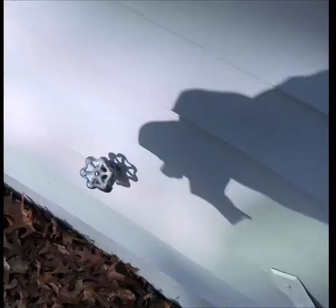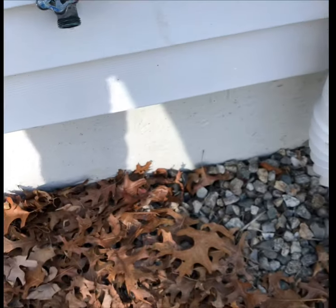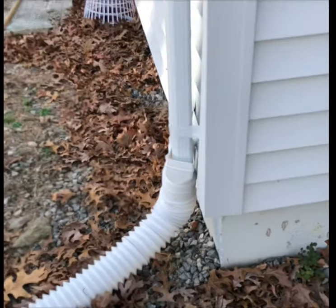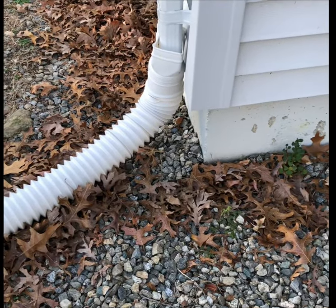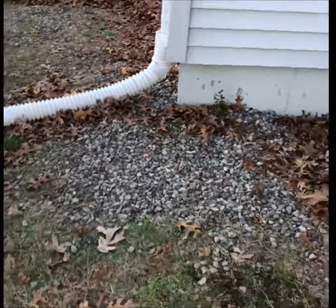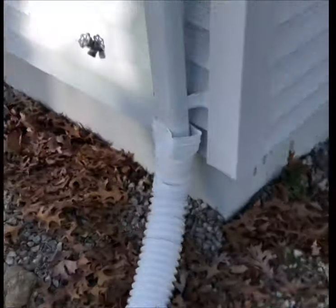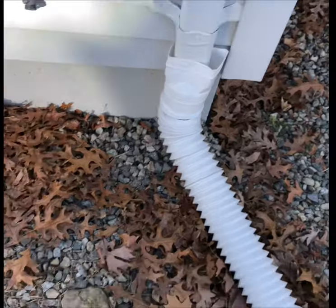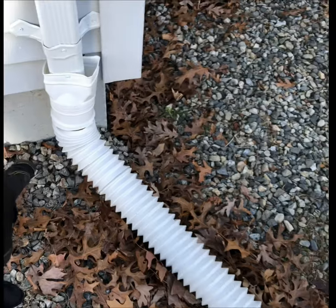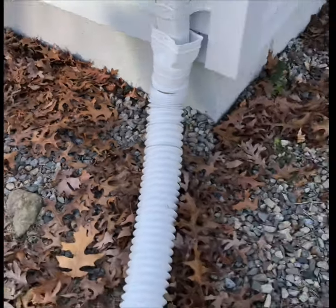When it comes to water you gotta be careful. I used this hose to flood certain areas while mopping it up, and I found the leak is that downspout with nothing on it - goes straight down. For 20-something years it's been working its way down. The water comes in under two minutes when you put the hose there. A foot to the left or right of this downspout the water won't come in, but right there it flies in.